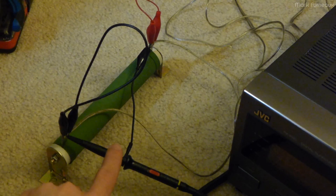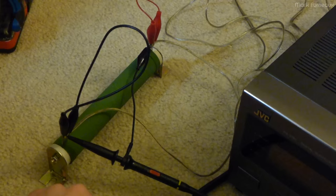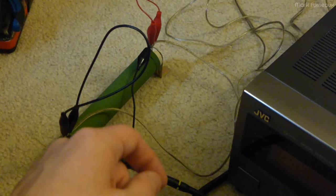Because this is a resistor, it's floating, so the output of this amplifier is floating. Some amplifiers may not be floating, so you should always check between the terminals and chassis ground — mains earth ground. This amplifier only has a two-prong plug so there's no earth ground, but if you have a grounded amplifier, check that the output is not earth-referenced, because if it is and you connect a scope ground incorrectly, bye-bye oscilloscope.